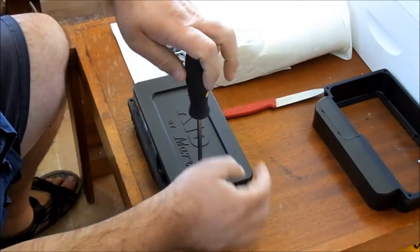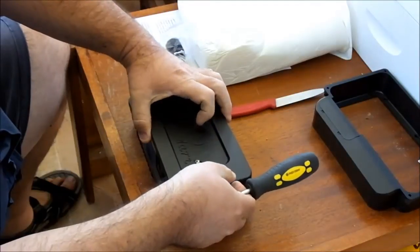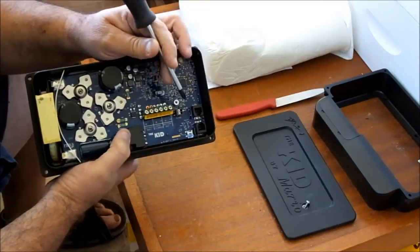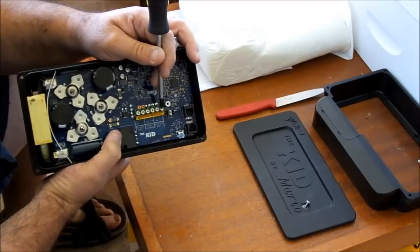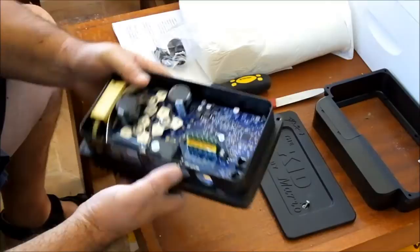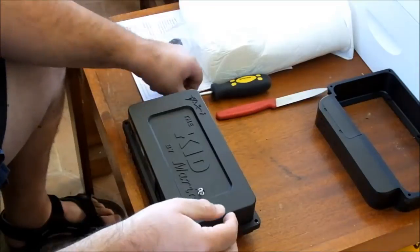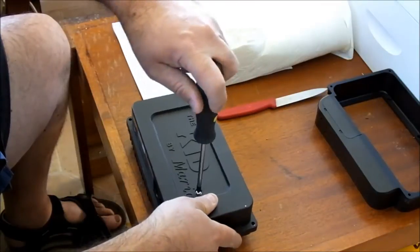Let's open her up and see what we've got in the back. One screw — easy. So I've got a terminal block here, DC input here from the solar panel with the output for the load, and we've got the output to the battery. All fairly simple anyway. I don't know exactly where I'm going to use this yet — might be going out in the shed. I'll set up a couple of panels on the shed roof, might set up a 12 volt or maybe 24 volt system out there just for running a few small tools off.